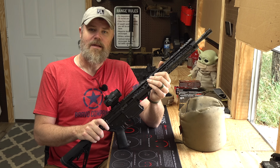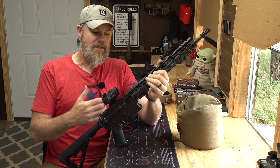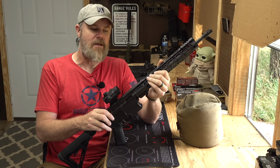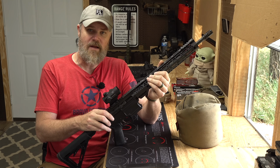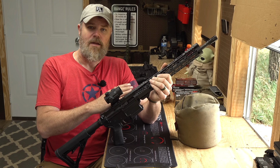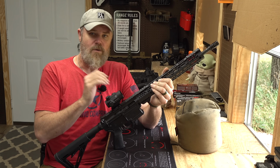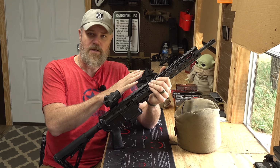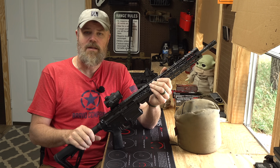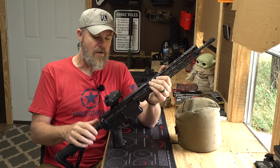When the gun came back, it didn't come with anything in the box that would indicate what they did to the gun to remedy the issue of it not picking up the rim of a live round in the chamber. We never had any functional issues with the gun. Anytime the gun fired, it would cycle perfectly. We wouldn't have any problems. That's because the recoil impulses are pushing that case back. It gets the rim underneath the extractor and out she would go.